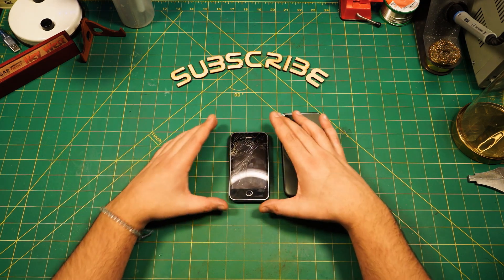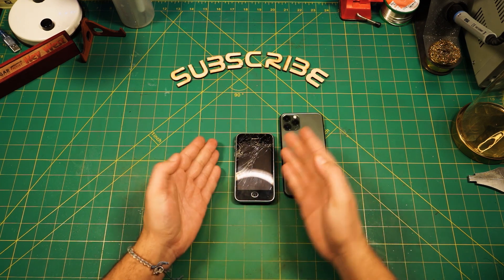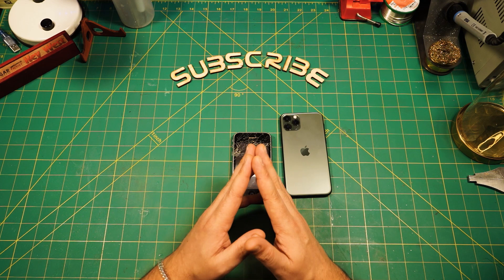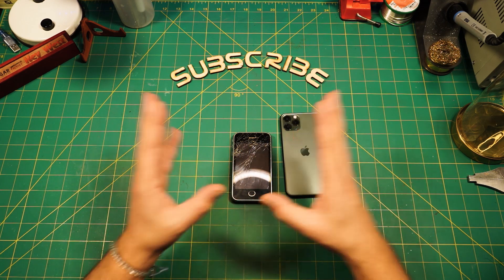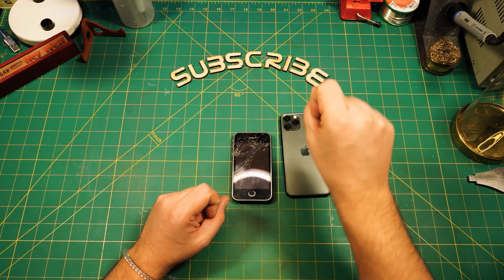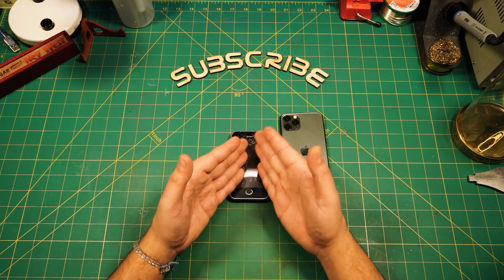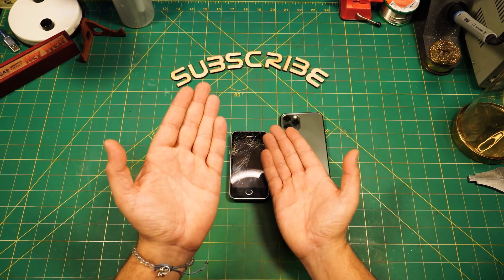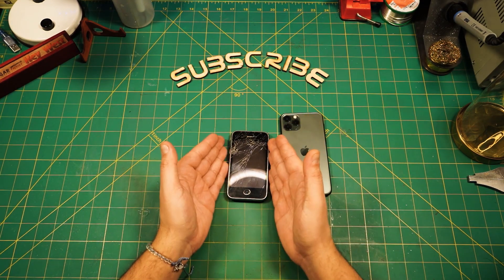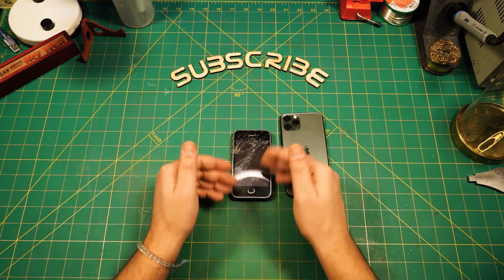To keep it educational: I need to get an exact footprint of this phone in order to create my mask. A friend of mine — an old school guy — once made me a technical drawing for parts that needed to be cut out, and some of them had pretty organic lines, so it was pretty hard to recreate. What I did was simply take a picture of his drawing, changed the contrast to be real black and white so the drawing is black and the rest is white, and that was enough to make a decent cut on the laser — a very easy, simple, and quick way of getting your mask or layouts into the laser machine.